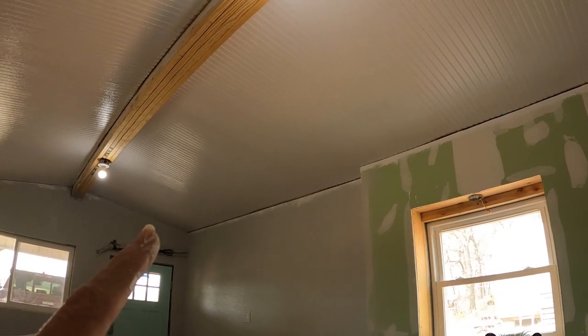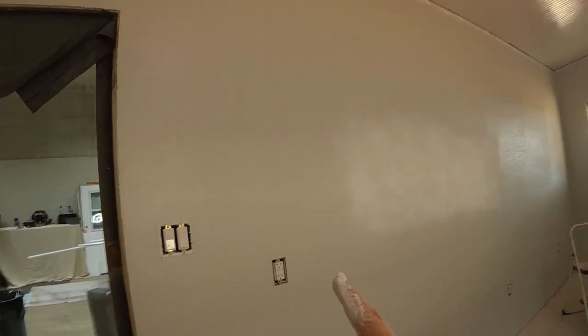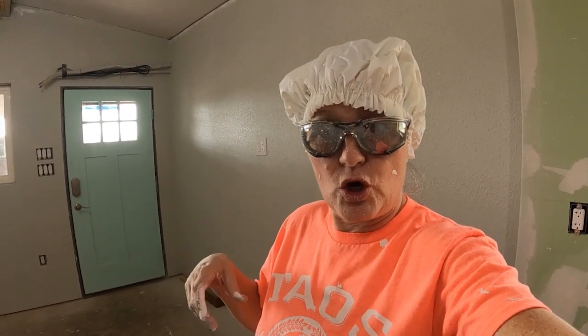You probably remember when we tried to tape all this off to spray paint the ceilings - the paint tape wasn't sticking, so I didn't even bother. Plus there's crown molding that's going to cover most of that, so I'll cut in anything that needs cutting once we put the trim up. You saw me use the Kilz stain block on that part of the wall where the finish was different from the samples. That was three more gallons of ceiling paint - the three-gallon bucket we filled back in October or November: I put Press'n Seal over it and even left the roller and grate hanging over the bucket, and that paint was still good today. Used it all up.